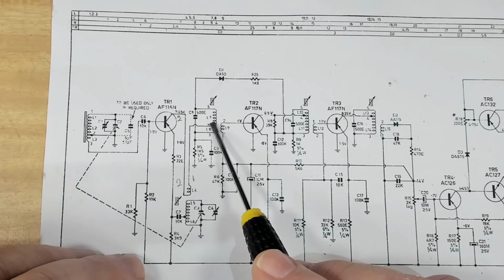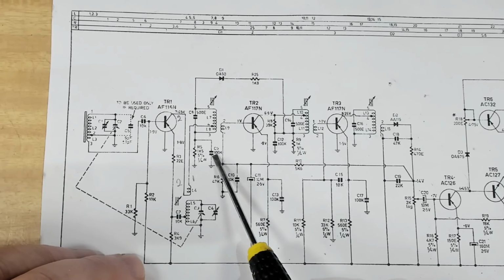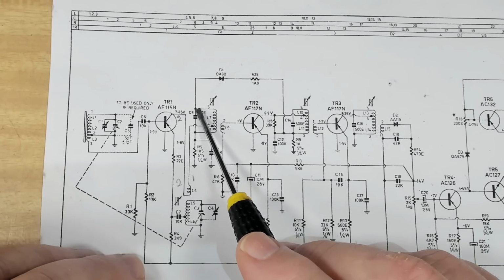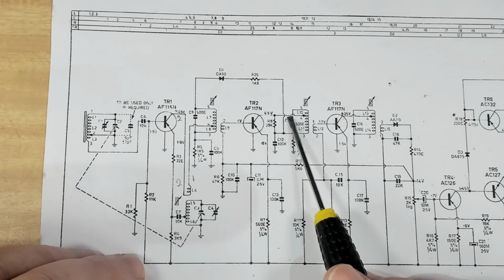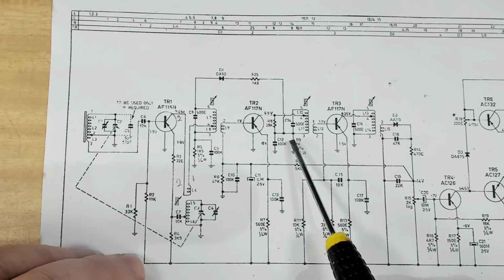So this goes through. That's the first IF. There's a resistor there, gone low, pretty unusual. There's a capacitor. It comes up through the coil here. Another capacitor there, I guess, off here. Then it goes down to ground. There's capacitors and resistors over here. So something in there, there's a short in there somewhere. It has to be. Something is pulling that down.